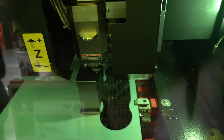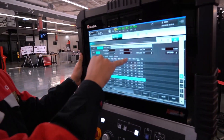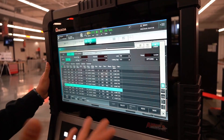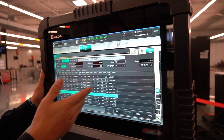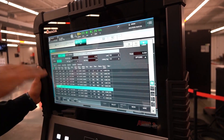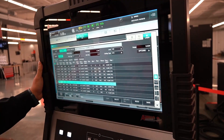We have it set here — we changed the thickness to the height of the part. Within the cutting condition, if you're processing a box after bending, you have to make a separate cutting condition. You would copy the standard condition and then input all the heights and Z values for the new part.